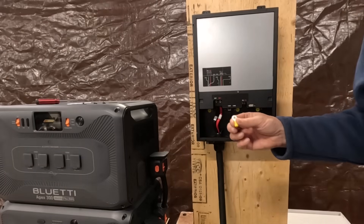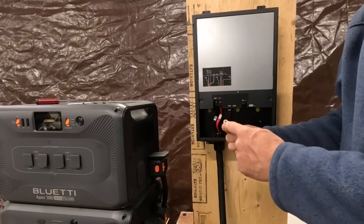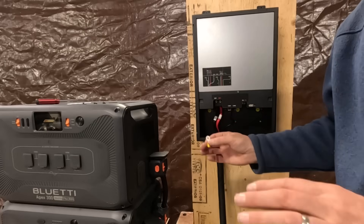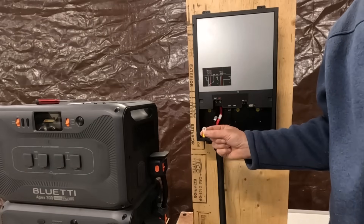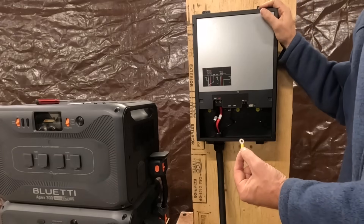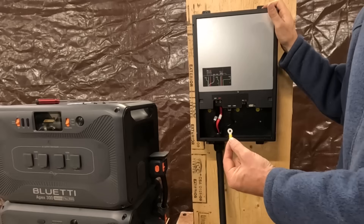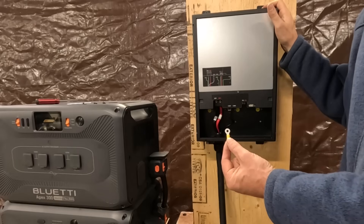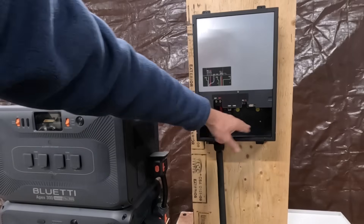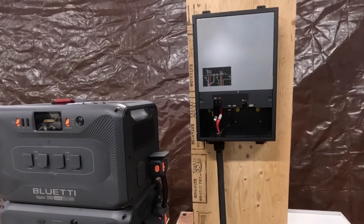This number 10 cable needs to go back to your electrical box — there must not be a parallel path to ground. We're dealing with high voltage here — up to 500 volts — so you must observe all safety protocols and properly ground your system. If you're unsure at all, consult an electrician. Normally you would see a green wire come from here, out through this knockout, and over to your electrical panel. That's the safe way to do it.